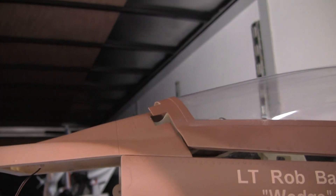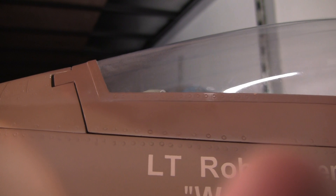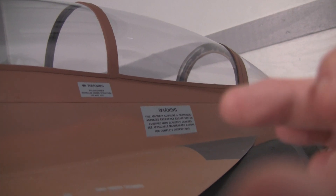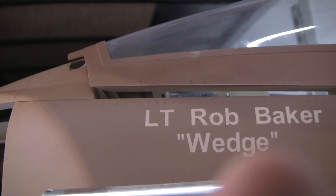This one essentially unlocks the back end of the canopy — it lifts it up. There's an actual tilt connected to it, so it lifts the back portion of the canopy up and out. So that's unlocked, and then locked. When the canopy is like this, you can't open and close it — even without the pins on the front that go into the forward frame — because all this stuff hits. So what they did is add one air cylinder that simply pulls the canopy back and allows that pin to come out of the forward lock.